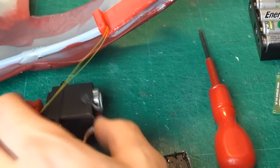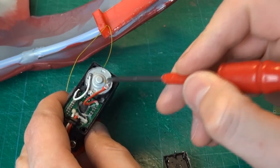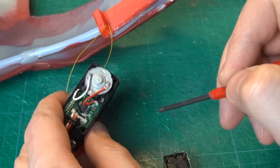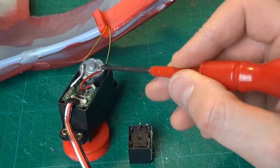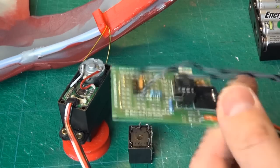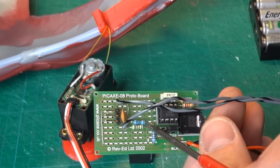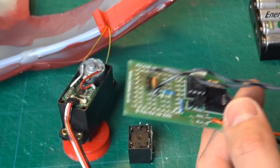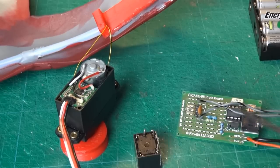What we'll need to do is run some wires out of this servo — probably breaking the red wire and connecting this terminal to the other terminal instead. We'll need to disconnect the power first — that's very important — before we short the motor out. The changeover relay is ideal for that because it simply disconnects one terminal on the motor and instead of connecting it to power, it changes over and connects it to the other motor terminal. We've got enough output pins on the PICAXE: one for the switch input, one for the servo output, and I've still got two more — one to turn the lights on in the eyes, and the spare one to switch this relay.